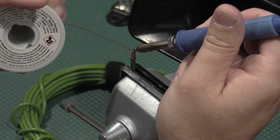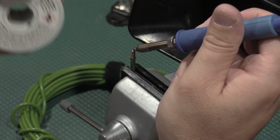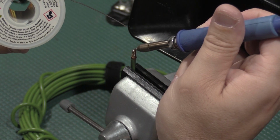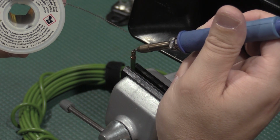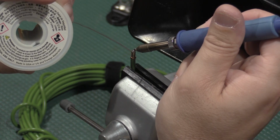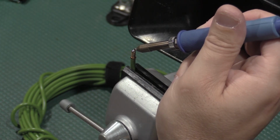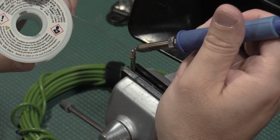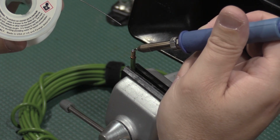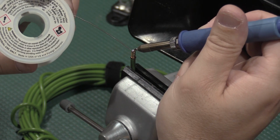Now, because this is just wire, we have a silicone meter lead and brass fitting, I am dumping a lot of heat in here. This is a really long dwell time for a soldering event. Especially on a board or something like that, I'd be roasting the board at this point. So this connection itself is very tolerant of high heat, where something else may or may not be.